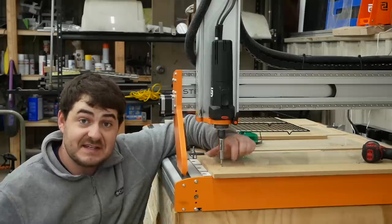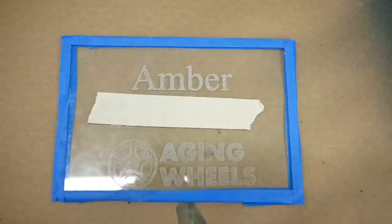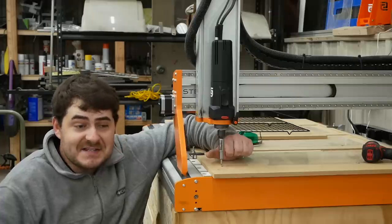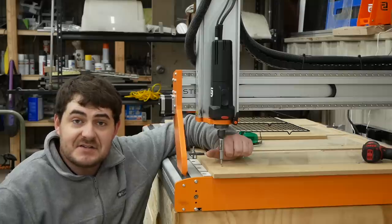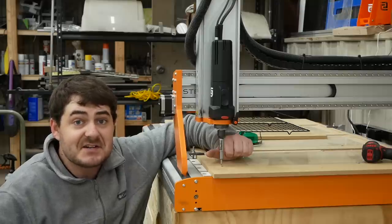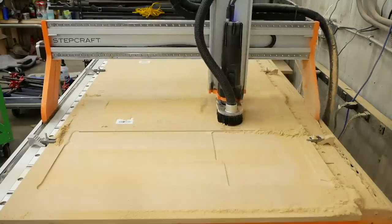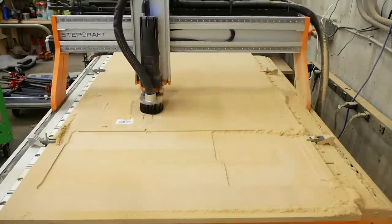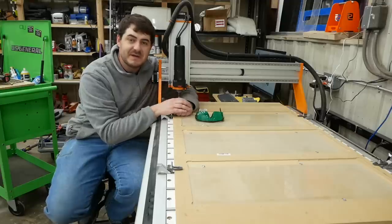The reason I'm not using this is because here's the results from the laser, and here's the results from the diamond drag bit. The diamond drag bit results, while passable, are substantially worse. The reason is quite obvious — the laser uses a pinpoint accurate laser, while this is a big dumb scrapey pencil. As you can see from these window holding templates I've already made, I'd already gone to a bunch of work setting up the CNC router for batch window engraving before I found out the laser results were too much better to ignore.